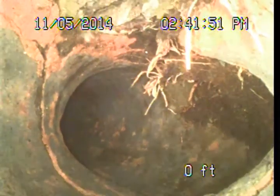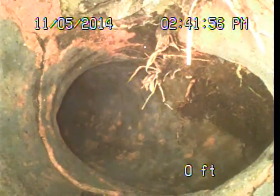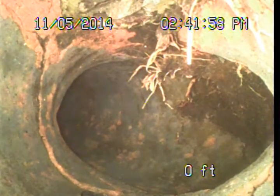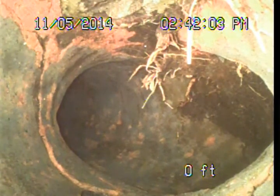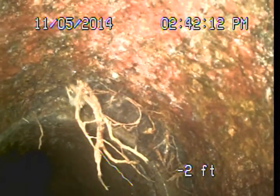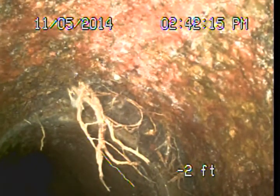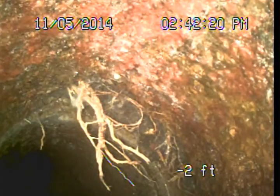If we tilt the camera up this way you'll see much more significant damage. The problem here is this can tend to over-saturate the soil around the building — you've got water seeping out of this consistently, and that can adversely affect the structure over time. You combine this with the section of original cast iron right here as you come out of the building. With the connection from cast to clay, you're going to see a hole there, and that's allowing roots in. This short section of cast iron has basically started to fail.